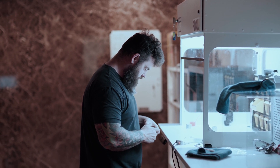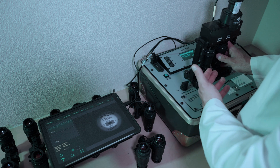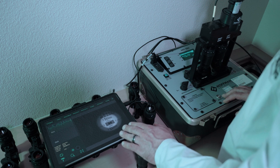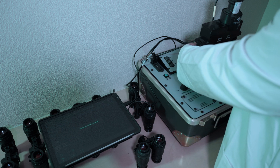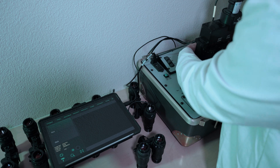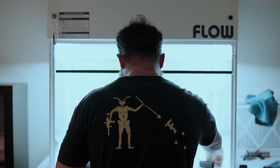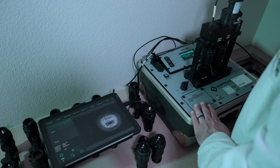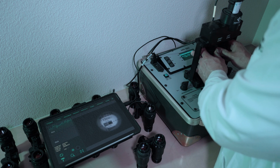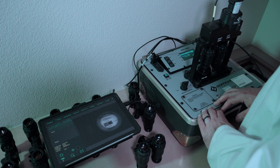Some housings, this is not really a possibility without shimming the tubes, because the bore tolerances are too loose and the images will be offset too far apart. In those cases we will either shim the tubes or find a way to get them as close as possible. I usually verify this by actually using them to make sure it is acceptable. If I can't get an exact crosshair-on-crosshair collimation, with certain housings the closest you can get may still look off — in which case we would shim the tubes and bring these images closer to alignment.